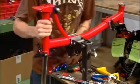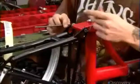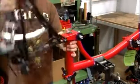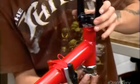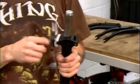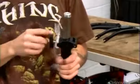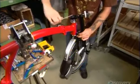Once the mainframe assembly has been painted, it's ready to be joined to the rear frame. He attaches it by bolting the hinge, twisting the bolts to just the right torque. He tests the folding and unfolding action of the rear assembly and checks the lock to confirm it functions properly. He installs the steering mechanism and wheel fork in the front of the frame and bolts the front wheel to the fork. He verifies that the assembled steering column and handlebars are in working order, then slides them into place and adjusts the column so it folds at just the right angle.